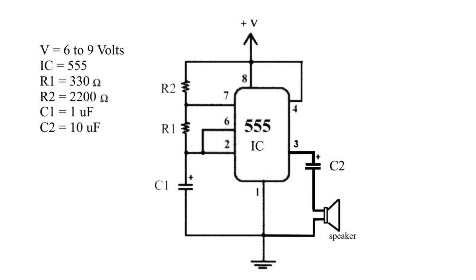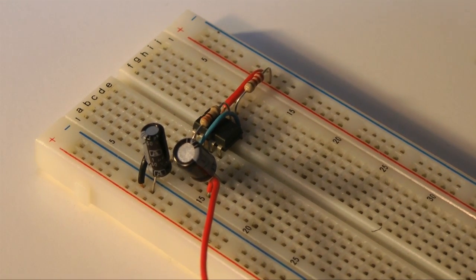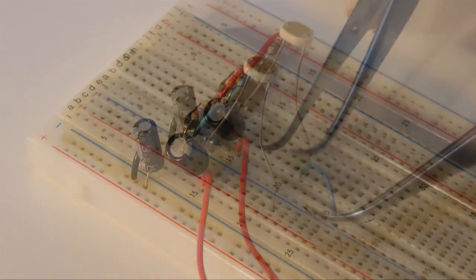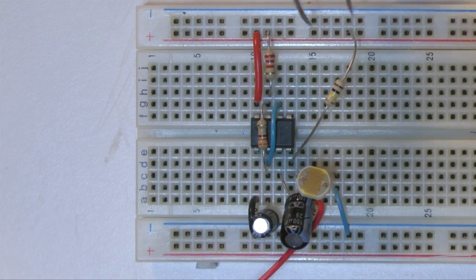This is the circuit diagram of the circuit we have completed, and this is the diagram with two new components: a 100,000 ohm resistor from pin 4 to the positive power supply line, and a light-dependent resistor connected from pin 4 to ground. The first step is to remove the wire connecting pin 4 to the power supply line. Next, connect the LDR from pin 4 to ground using a short blue wire, then connect the 100,000 ohm resistor from pin 4 to the positive supply line, the red line.